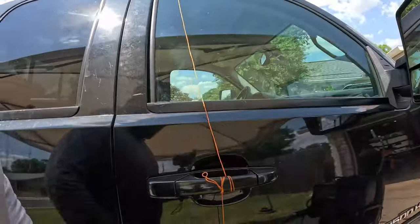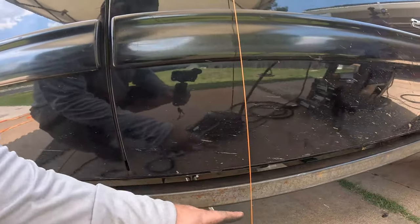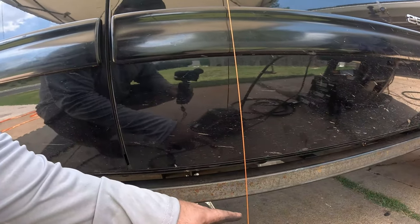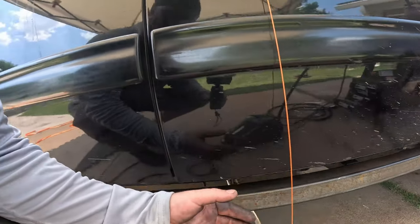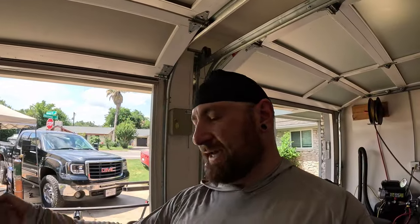Additionally, as I mentioned earlier, coming back over here to the truck, we have this plumb bob, and the distance from here to the plumb bob is 4.5 inches, which means that the outside of this pipe has to be 4.5 inches. So if we make the back wider at 5 inches to the inside of the pipe and 6.5 inches to the outside of the pipe, because it's 1.5 inch diameter, that's going to make everything look right and feel right. That's what we're going to do. So the next step is I'm going to cut this pipe and we're going to tack it onto the truck.